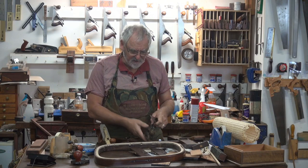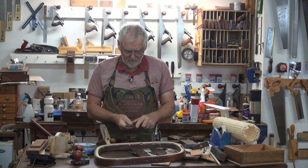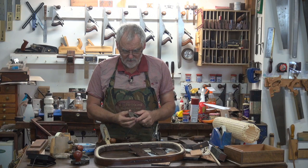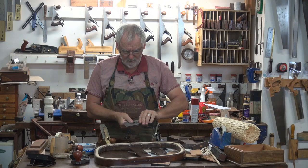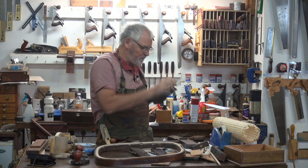The other thing is making sure that your plane is set up properly and you haven't got too much blade out. But on my shooting planes, when I'm doing edge work, I just keep it square. So it's not detrimental to do it at all. But I just looked at the state of those blades in my H&Ts. Terry would be horrified.